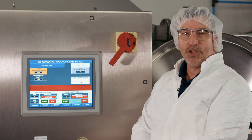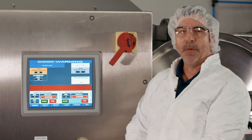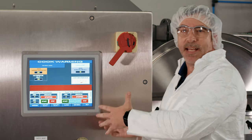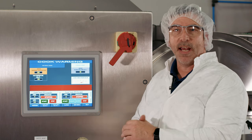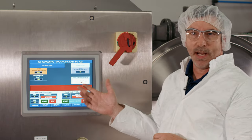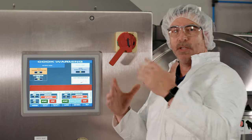For example, with 800 to 900 pounds in a 100-gallon blender, you can transfer the product by opening the outlet valve and pump, sending it to a hold tank — which we also provide. That hold tank maintains product temperature. The operator then starts the next batch in the liquefier, repeating the cook cycle and warm stage as needed. The finished icing or glaze is transferred to a hold tank or directly to an applicator.